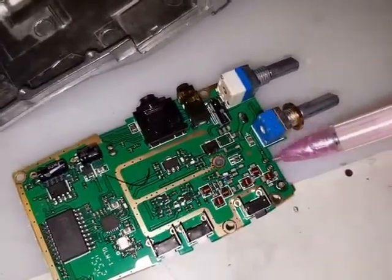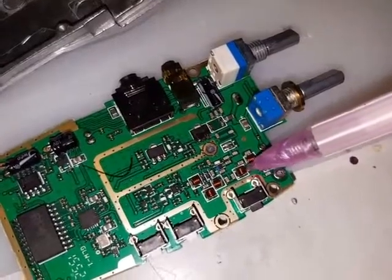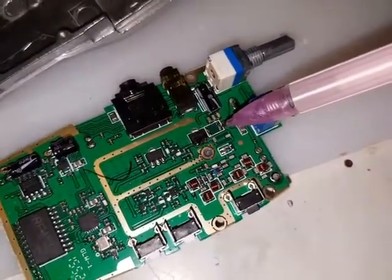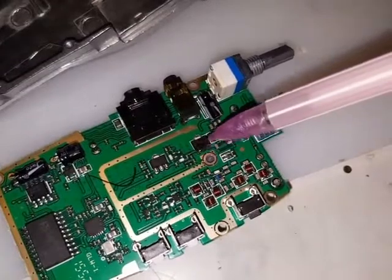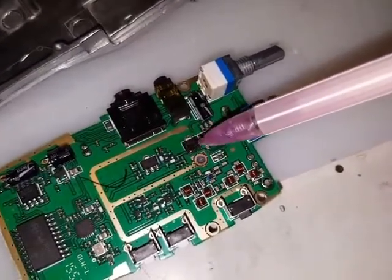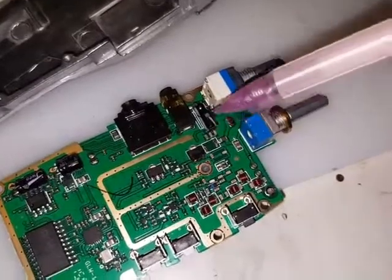There's a white LED that goes on here but I've taken that out. What I normally do is take out this inductor here — I've removed it but it looks very similar to one of these, just a little coil. This effectively stops the RF from getting back into the battery whilst allowing the DC to pass. Take this out and you remove all the power off this, so we're only running on driver power. It capacitively couples across this transistor and you get about a milliwatt or so out, which is enough for around-the-house use.